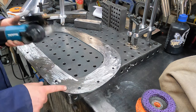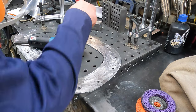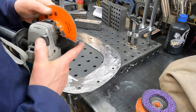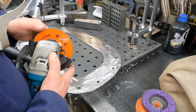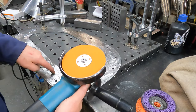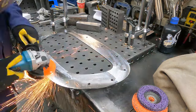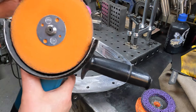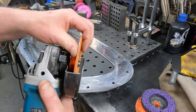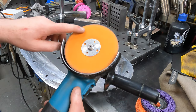For the surface finish, back to the welding store — instead of going to the box stores I went to the welding store and asked what the pros use. This is what the pros use: it's an 80-grit CoolCut XX. Let's see how it performs cleaning this surface finish up. After all that work, just bleeding off the very edge of that disc and it's still super sharp on the inside. I'm actually really happy with the performance. Apparently you can even get a different backing pad that improves it a little bit. That worked great — so much better than the other junk I've had in the past.